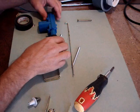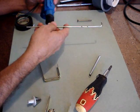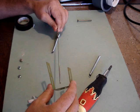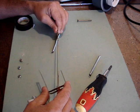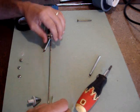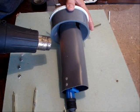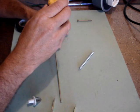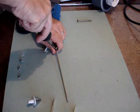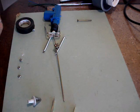Here's the actual assembly of the parts and the way they go together. The push rod goes through the end of the actuator and then you'll install the brackets. The brackets are pre-bent to fit on the end of the 2-inch PVC. You'll heat them up with a heat gun to get the shape that allows them to slide into the PVC to hold the actuator properly in position.